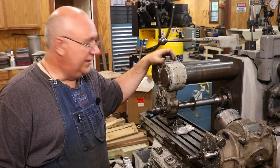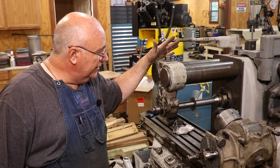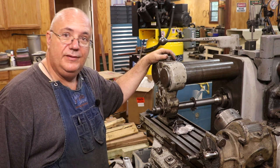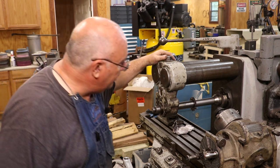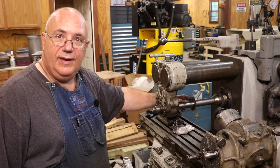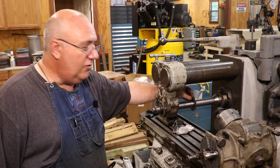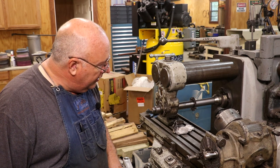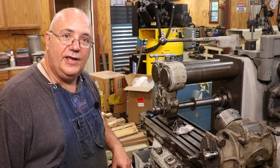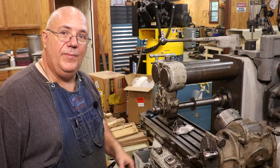Well, there we go - problem solved. Needed a custom arbor instead of having to send it out or try to find a next-to-impossible-to-find size arbor with the bushings and the nut and everything else. Hey, we got a machine shop - we'll just make it. That's exactly what we did here, and this should serve the purpose. Next time I need to use a bevel involute cutter, I've got a bunch of cutters that are exactly like this with that same size hole - now I've got an arbor to mount them on for future jobs. Guys, that's going to be a wrap. As always, thanks for watching. Please subscribe to the channel if you haven't already - comments are appreciated as are those thumbs up. We will catch you on the next video - hopefully be making some bevel gears soon.